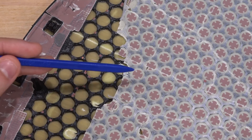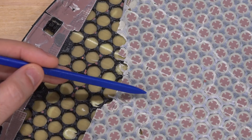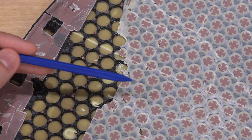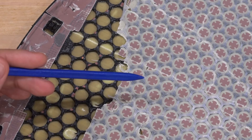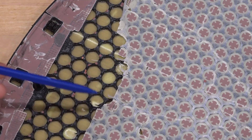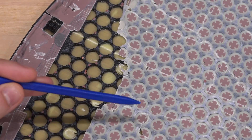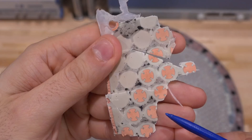There are tiny dots on each of these circularly polarized antennas — each has a tiny dot right there in the slit, which is essentially a small drilled hole. That is most likely to equalize the pressure between the cavity formed above and below the antenna as the unit goes through various thermal cycles, ensuring there is no bulging or popping between the antennas and the PCB. Overall quite well thought out. There are roughly 1,200 to 1,300 elements in total — quite a nice, uniform, large structure.